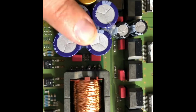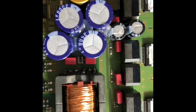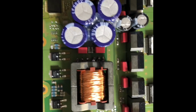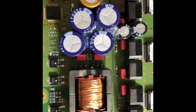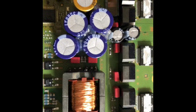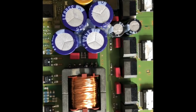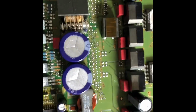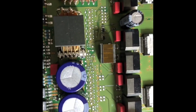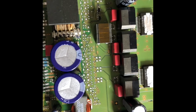They replaced the capacitors. You know, somebody thinks that replacing capacitor is going to make a better quality of the amplifier. This is Class D. It's not Class AB. This is a digital amplifier. It's not going to make much of a difference at all. But probably they charge that guy pretty good money to upgrade this amplifier. This is so ridiculous. Okay, they replaced the film capacitors with the film capacitors. What's the point? You know, oh, it's audio quality, that's not audio quality.